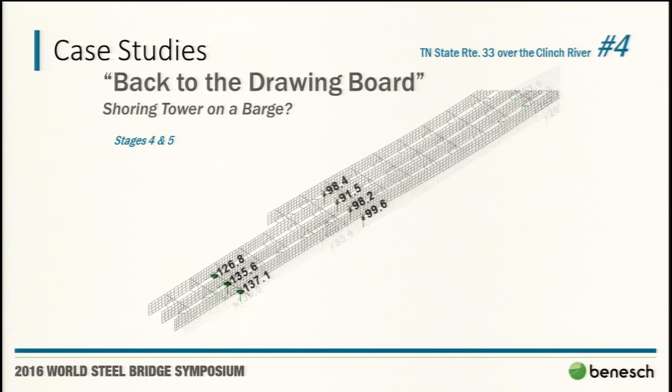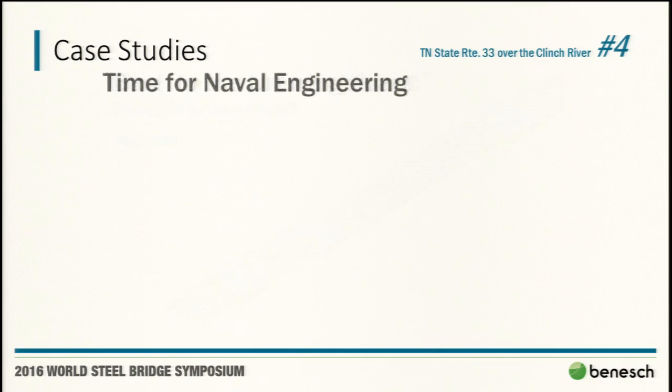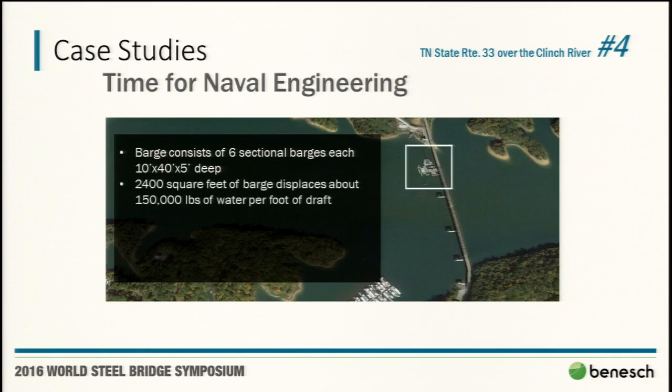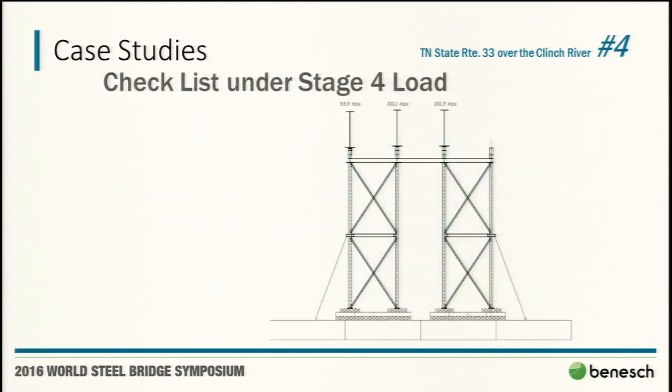See what, get to the pier. So again, we're looking at everything in conjunction with, is it feasible to build with the cranes they have, with their capacities, and then what is the load? So we ended up with a total of 400,000 pounds. The barge configuration they wanted to have is illustrated here. So basically we figured out that, okay, I suppose it's feasible. There's a fighting chance to get this to work. But obviously the list was still our big concern.